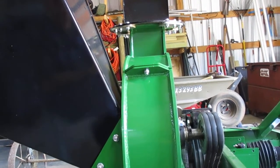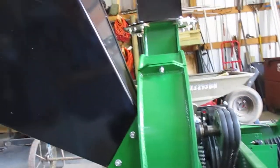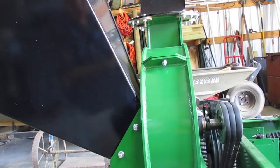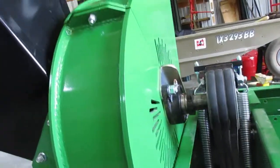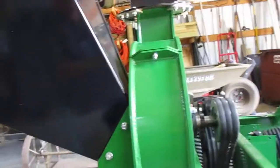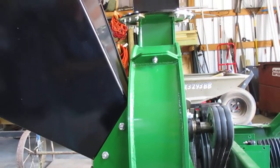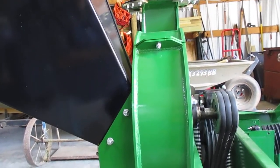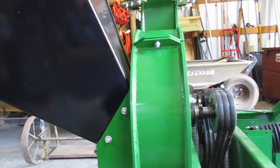On the knife blades there are four knives — two upper, two lower — two bolts each. About half those bolts, I got at least a quarter turn on. On the back side you can see the little slots cut in the housing where you've got blower vanes — that's quarter to three-eighths formed iron, two bolts each. Half of those were not tight either. Had to go back and tighten all that.